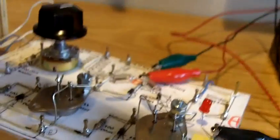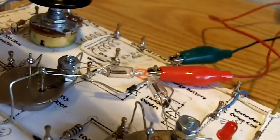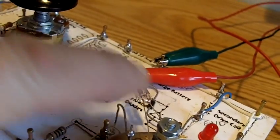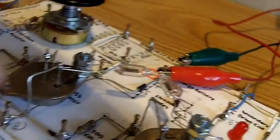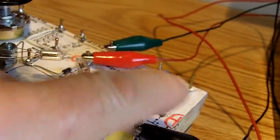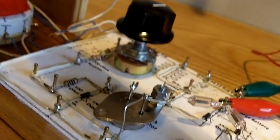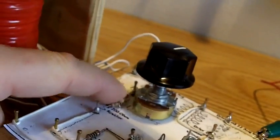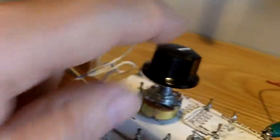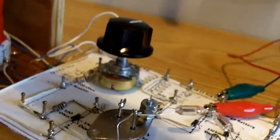I did make some minor changes to his circuit. I put in a couple of neon bulbs to protect the transistors, and I put in a little LED just to tell me that the thing is on. I put in a pot — I measured the resistance and came up with 1,310 ohms — and fixed resistors with a 1K adjustable pot. I have something unique about that I'll talk about a little bit later.